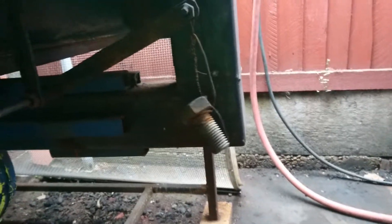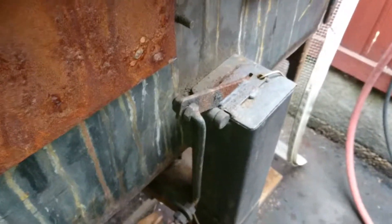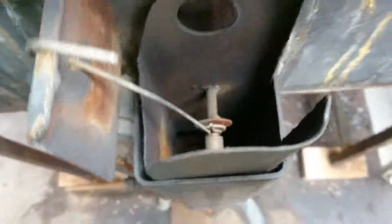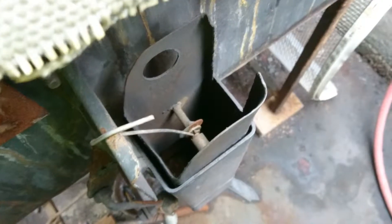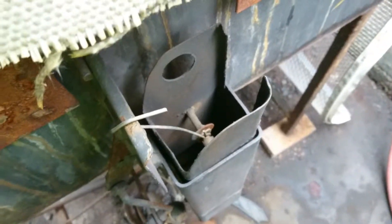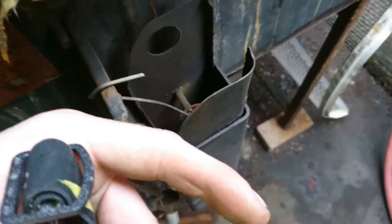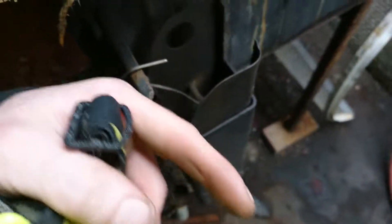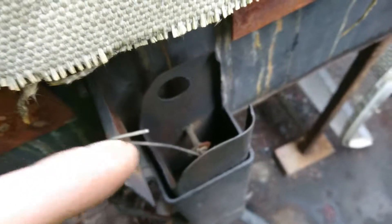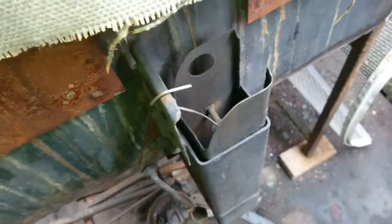That moves this — there's a bit of counterweight there because I'm not exactly a scientist when it comes to working out pressures and weights. There's a slide in there with a hole cut out, and that hole when it's closed matches the hole for the air that flows through. If you don't have that in, you'll still get air blowing into your fire, and also because of the huge amount of air coming up past here, it'll actually backdraft — you start sucking fire through your air tube into your water tank, which obviously is not good. So a three-way valve is pretty much a necessity.